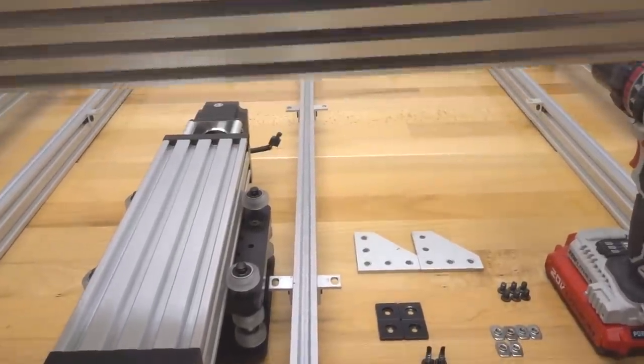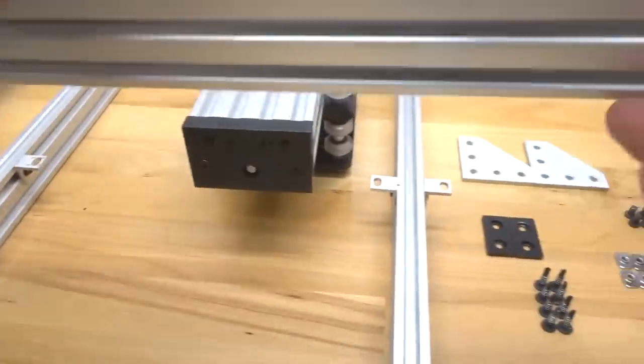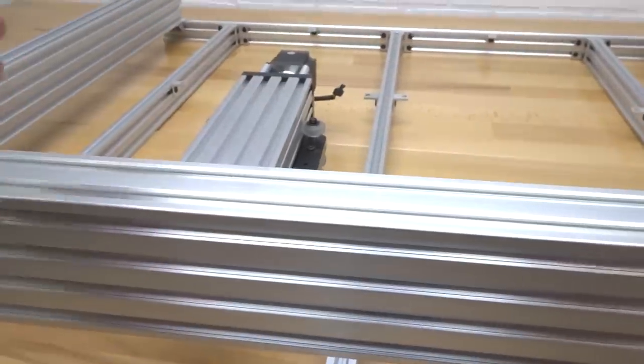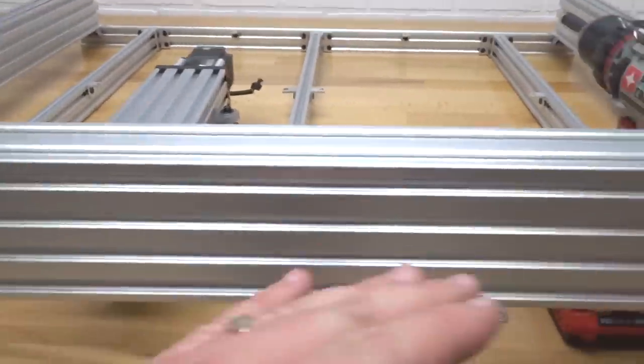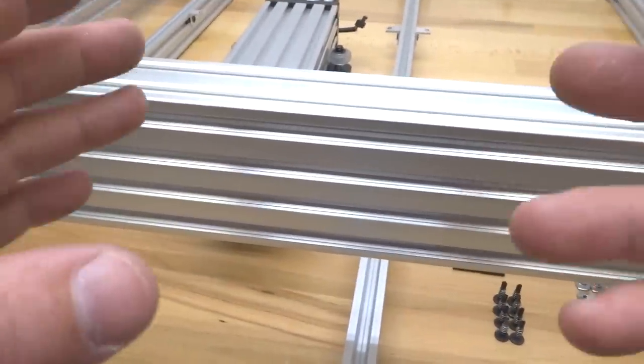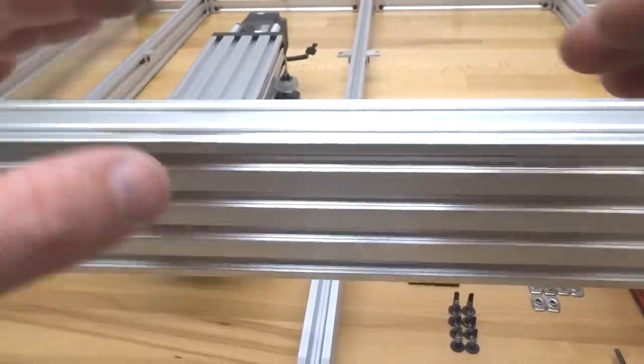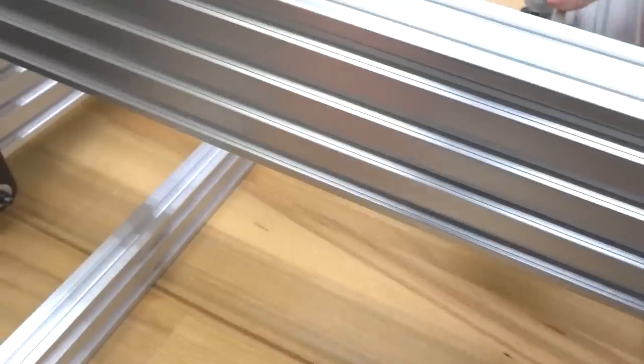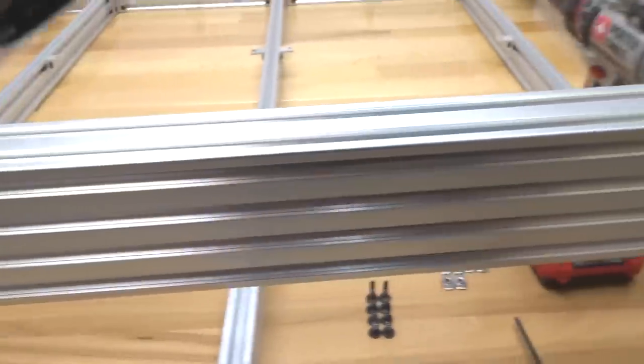It's going to be at 1,000mm, and we're going to rest this here on each one of our Y-beams, like so, and we're going to take our assembly and run it onto this X-axis. So we're going to adjust our eccentrics, make sure that we have preload on this rail, and then we're going to assemble it to our Y plates here. All right, so let's go ahead and slide this on,